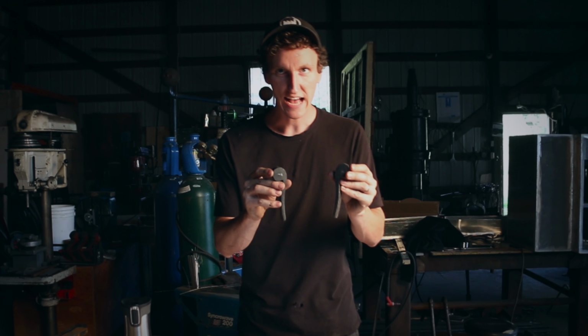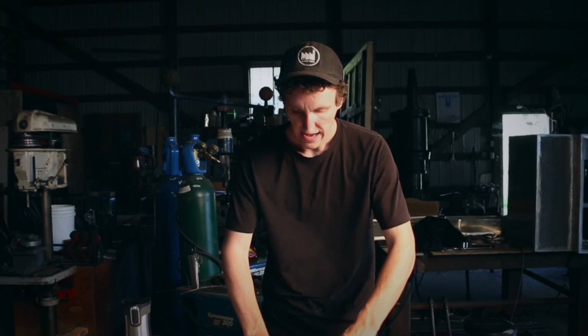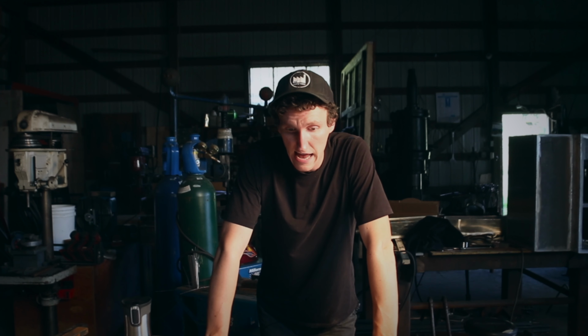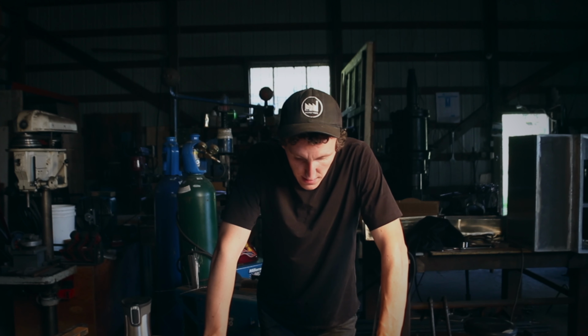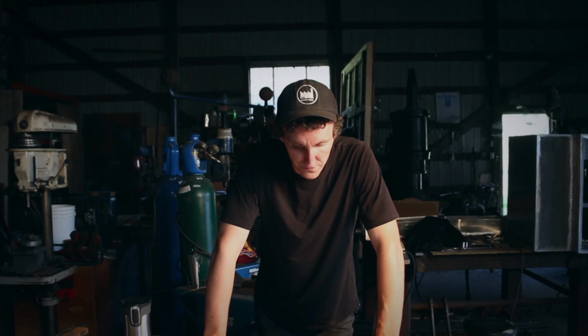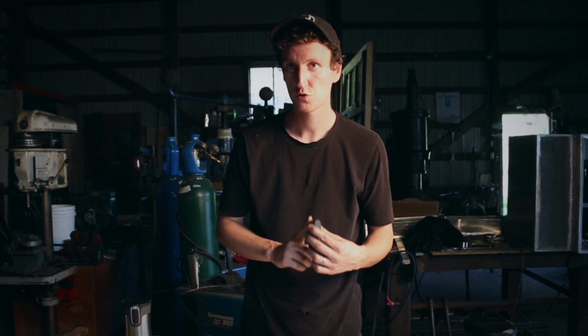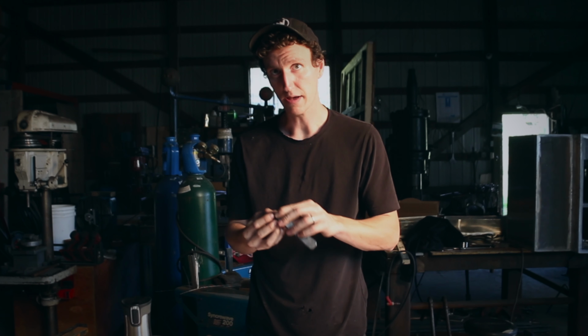Okay, so I just got these guys forged up. You just saw that. Really happy on how they turned out. I decided just to do it freeform between the power hammer and the anvil, making no special tooling for that. It's a little bit rougher than maybe it could have been, but I'm okay with the way it looks. So the next step will be to quickly drill a hole in the back of this, which will receive the part that Martin's working on, and then that'll be how the handle mounts basically to the door handle plate. So that's next up.